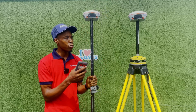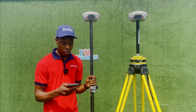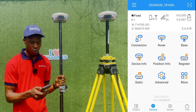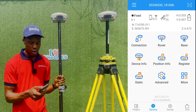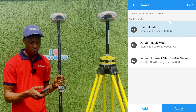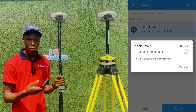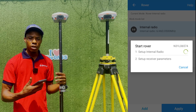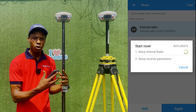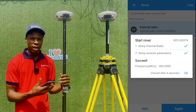Another thing is if there's interference in the radio range. What you need to do is go back to your rover setup on the device page, click on rover, and then reapply your internal radio work mode. Just select the work mode you were using before and reapply it — that will quickly re-initialize the connection and your rover can go back to fixed.